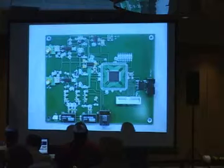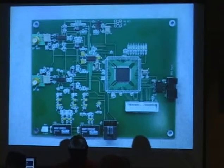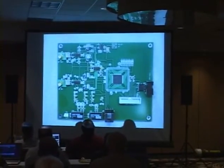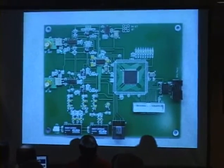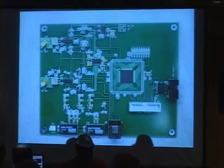And here's the hardware. This is the second generation board. This is the board that you saw in that photograph from Dayton. This is the board that was actually operating. I should say we made 7 of these boards, so it was one of those 7. Here you've got the digital signal processor. Here you've got the codec. And then let's see, this is the IF out. So this is the quadrature sampling exciter here, and this is the quadrature sampling detector.